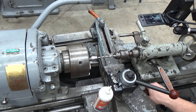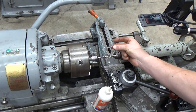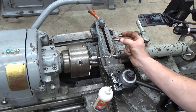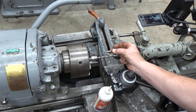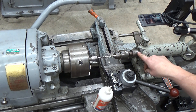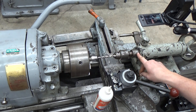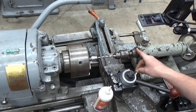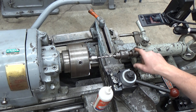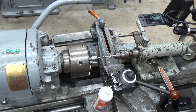It's very important when using the drill to make sure that the hole is as concentric as possible — start with a center drill, then chase it with the longer drill bit. And you can check your depth by using the scale mounted on the tail stock quill. So there you go.